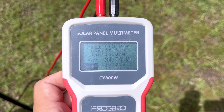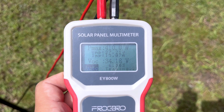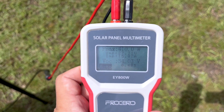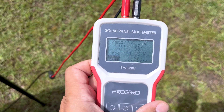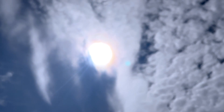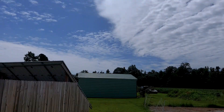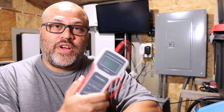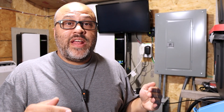It's about 75 to 77 degrees Fahrenheit. You would normally test solar panels in a factory at 70 degrees under scientific conditions — established parameters, same temperature, same distance from your light. As you can see, the sun is going back in the clouds so the watts are dropping back off, but 334 watts with a little bit of clouds — not bad at all. It went up to 410 watts, not under the factory test conditions that they used to come up with a 400-watt rating. Maybe they actually underrate their stuff — maybe it's like a 430-watt panel, and that's why it's getting above 400 watts.